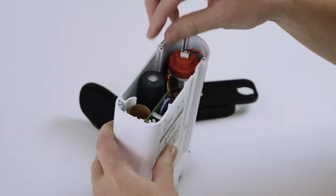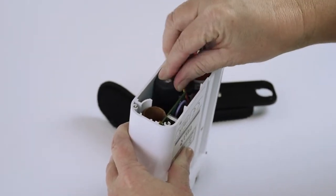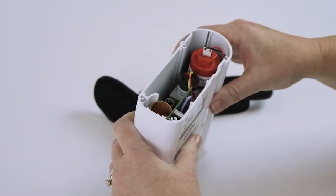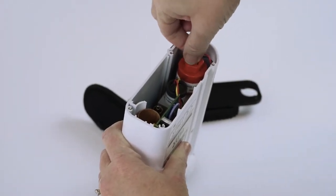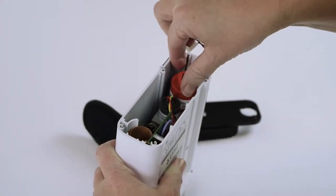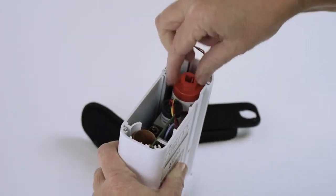The first operation is to remove the KMnO4 filter. An F-920 will not include this piece. Turn the filter counterclockwise and set it aside. The next step is to remove the oxygen sensor. Use the white bracket to disengage the cable and lift it out. Do not use the cables to pull the bracket out. With your fingers, turn the sensor counterclockwise to unscrew from the instrument.